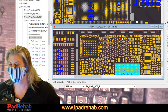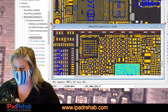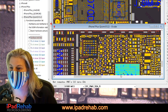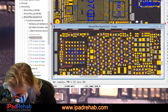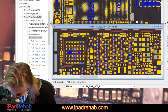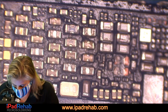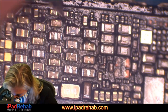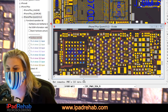All right, let's just make sure that old R2020 is not short to ground. Well, R2020 can't be short to ground. But what we're going to make sure of is that R2020 isn't on a line that is short to ground. All right, so R2020 is located. Let's see, there's 1, 2, 3 in that guy right there. I found him. R2020, that guy right there. Let's test R2020. You're not on ground by chance, are you? He said, nope, I am not. Exonerate that line. Very good.